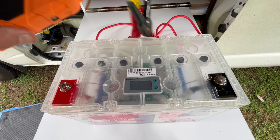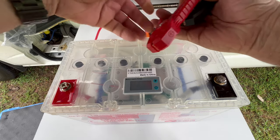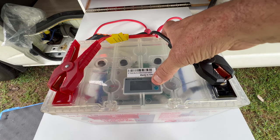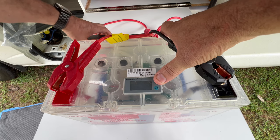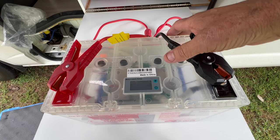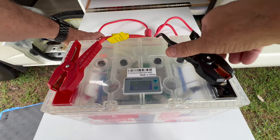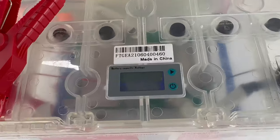You can get just a jump starter — your lithium jump starter that you jump your car with. Connect the positive, connect your negative. You can see there's nothing there. Now I'll turn the jump starter on and give that a kick. And as you see, the BMS has woken up.